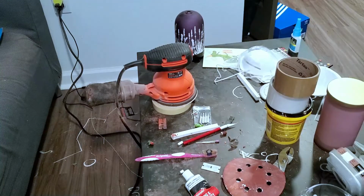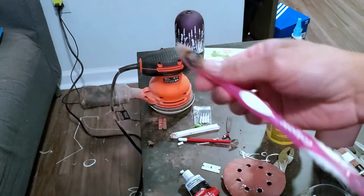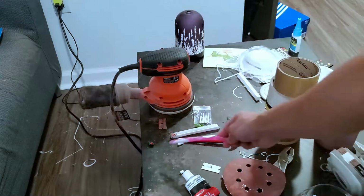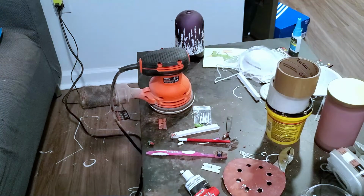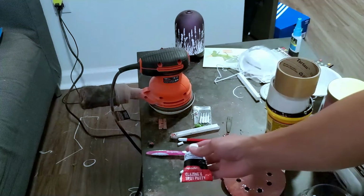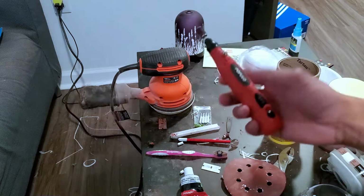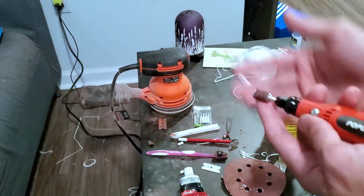Alright, if you're new to my channel, here are all the materials that I use for post-processing my prints. A palm sander, this X-Acto knife, this toothbrush, any old used toothbrush to get the dust off from when you sand. This Bondo glazing spot putty, to fill in holes or gaps or cracks in the prints. This smaller sander for the finer details.